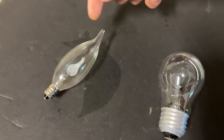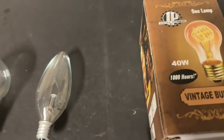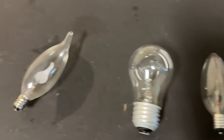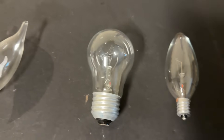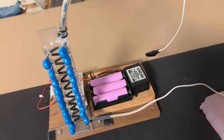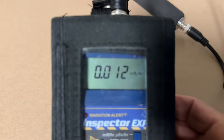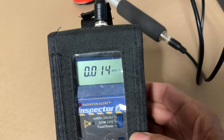We're going to begin with this neon bulb and work our way up to this vintage light bulb to see which one of these produces any detectable x-rays. The experiment with the neon bulb and the regular light bulb may also function as a great control experiment to see if high voltage electronic interference is causing counts to show up on the Geiger counter. Here's our Geiger counter picking up background radiation — the amount of radiation is very low.